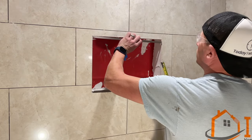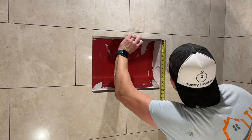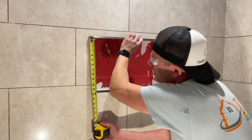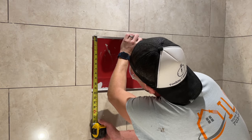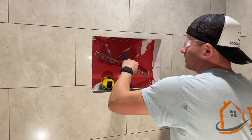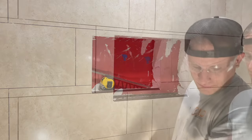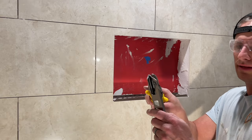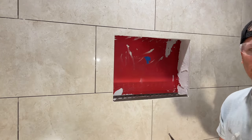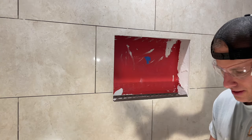What I do is hold both pieces together and measure. It ends up being about 12 inches on both sides. So I'm going to cut that right now and frame this out, sticking the jollies with mortar. I cut a little bit off the back of the jolly so they don't hit each other and you get a nice 45-degree angle.